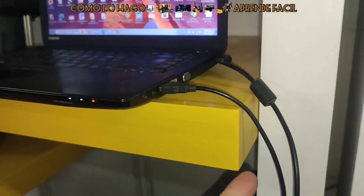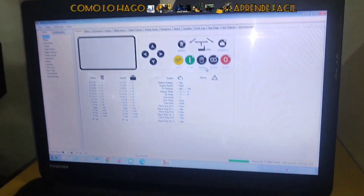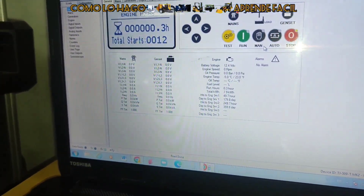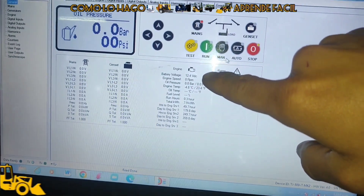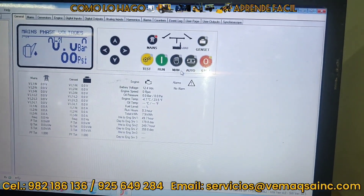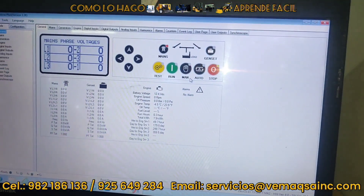Why USB? Because we are connected with USB — there are other ways to connect this. It opens the program and sends directly to the general part. As you can see, there is a green bar here that has been sliding. It has been completed, telling us it finished completely. It shows us the current state of the equipment — how it is right now. We can see the voltage of the battery, the temperature, and the hours of function. From here we can execute — for example, we can see that it is in stop. We can execute it to be automatic and do a manual start from here from the computer.